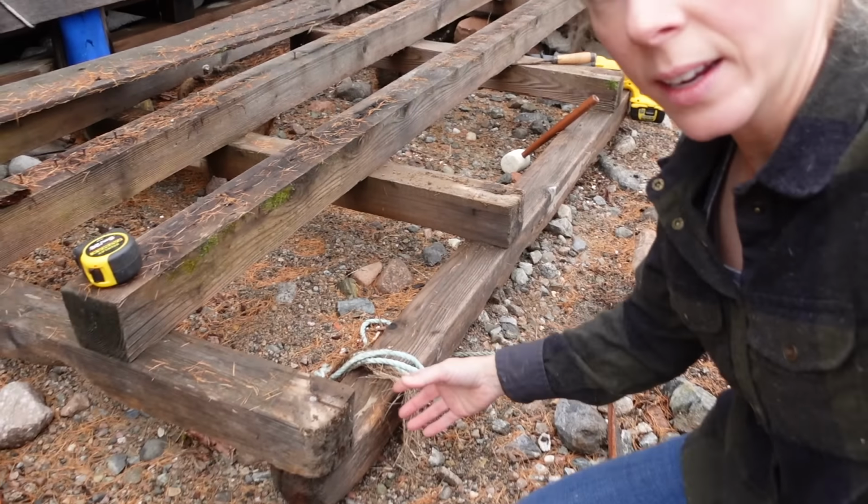I stayed behind. Steve took the dogs down. And I just want to try and figure out why this stove doesn't want to draft, and I can't figure it out. It just wants to die. It's supposed to be a foot above the ridge of the cabin, which it is, 12 inches. That's the main thing, from what I understand. This is closed, this is open, that's closed, that's open. So all the things that are supposed to be open are open.